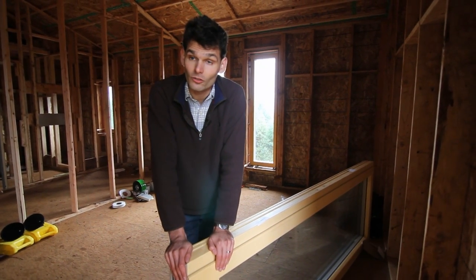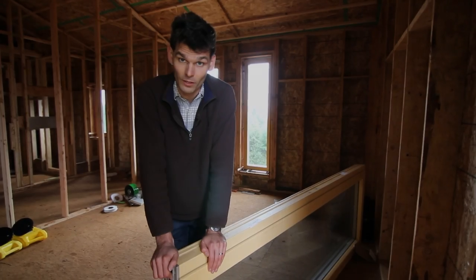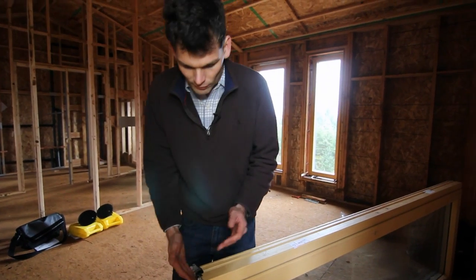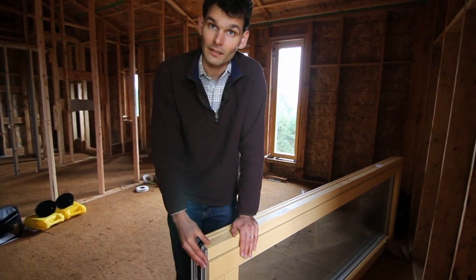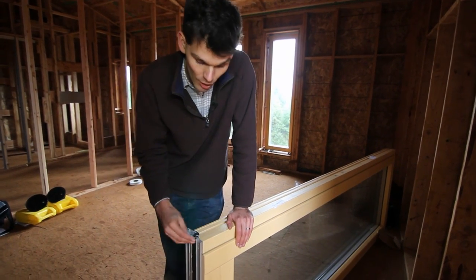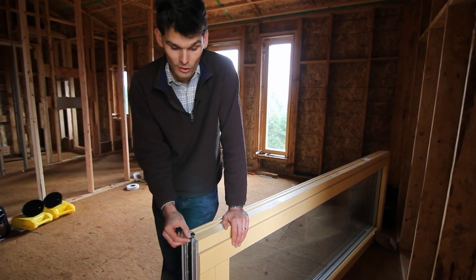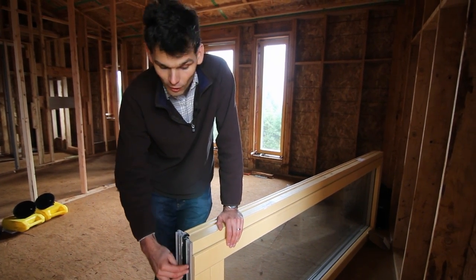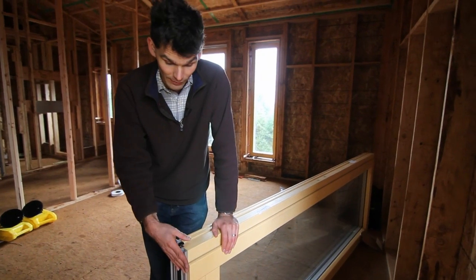This applies to all our doors, whether balcony, entrance doors, or terrace doors. The bottom of the unit has to be flush with finished floor. Since you install this unit flush with finished floor, you'll have to think of the strategy to create the interior air seal. We recommend either using a sealing bead or using a compression tape like Illbruck's compression tape, installed in the recess of this aluminum threshold, that then expands and creates the seal.